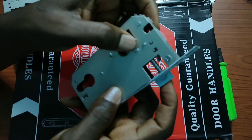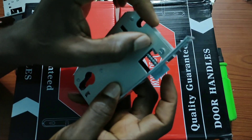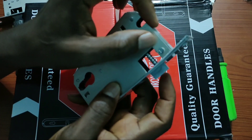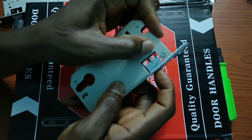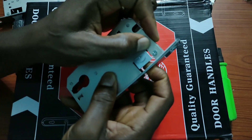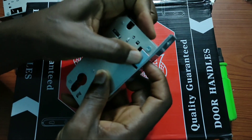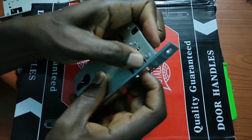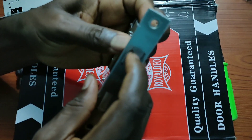The key thing here is that inside the hinge, there's a hole that holds it from going completely in. You can see it's actually movable — when you press it back, it holds the spring so the lock hook doesn't get stuck inside. If it goes up, the mechanism will get stuck inside.